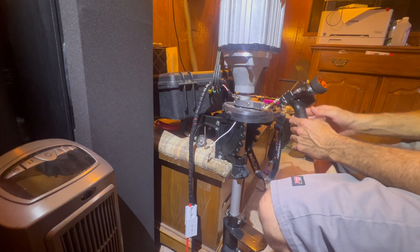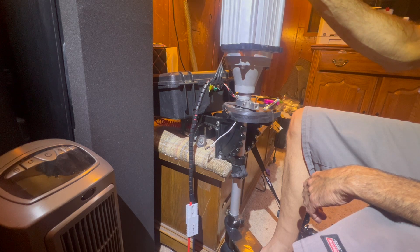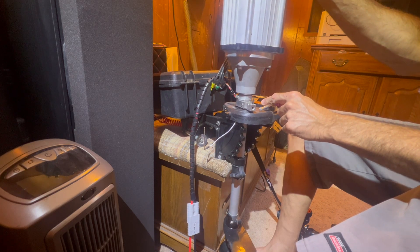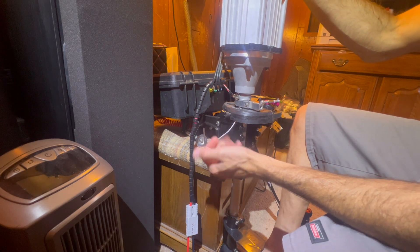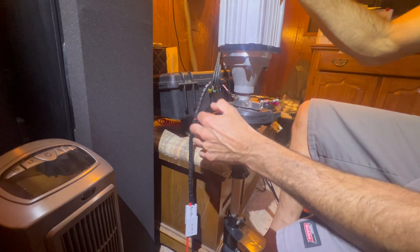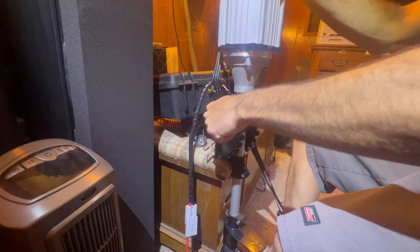Let's say you're fishing and you drop your radio in the water and you need a way to control your boat. Every time you throttle it up, this motor is going to turn to the right and the servo is not going to hold it — it puts some tension on it but not enough. This motor puts out a lot of torque. So what you're going to need to do is lock the steering. You remove this, take this pin out, and put the lock back in. When this bottom is out it pushes up against the propulsion shaft and keeps you from steering.